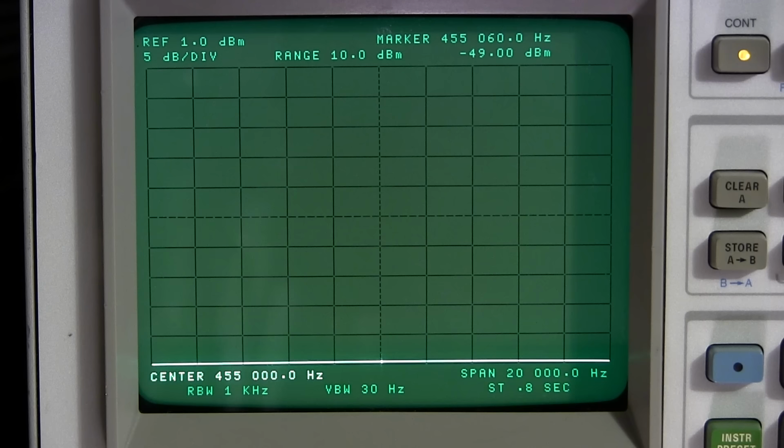So it needs to be in the receive position. The toggle on the front should be in receive. The BFO, the CW tone, can just point at 12 o'clock. It doesn't really matter where that is. The limiter can stay off, and that's pretty much it. Have the dial at the bottom end of the broadcast band, so the main tuning dial should be right at the stop at the bottom end. Okay, I think we're pretty much ready to go at this point, and I'll explain things as we encounter them. Okay, so here we go.